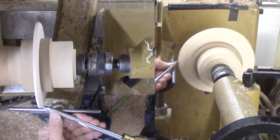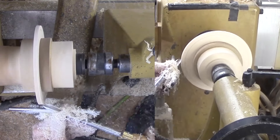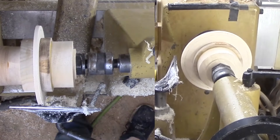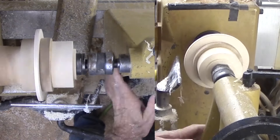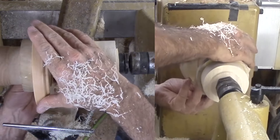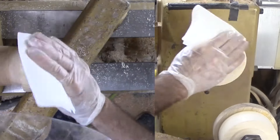Meanwhile, for the puzzle, I prepare a thin piece of maple again. It is thin enough already, but I still need to mount it with double stick tape and sandwich it between two faceplates so I can focus on fitting it into the center of the tray. I sneak into the fit — I do not want to overshoot and be too small. The laser cut will make it more loose anyway. This is a great time to sand and apply wipe-on poly on both sides, separated by enough time to dry. It is ready to go into the laser.